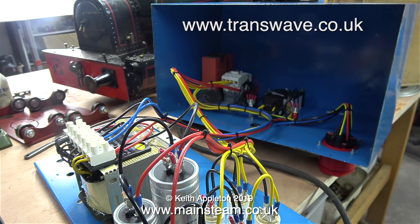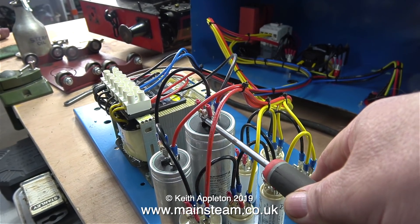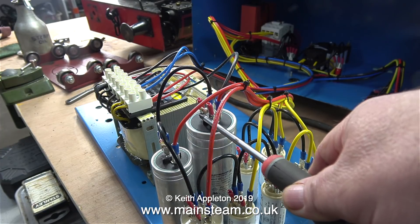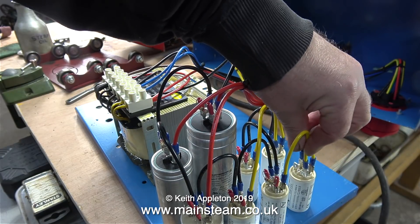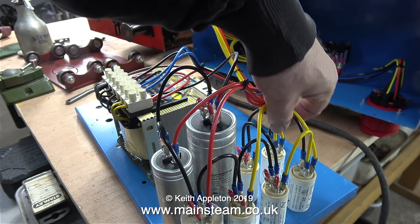In the bottom part of the picture there's a large transformer and here are the capacitors. I'm shorting them out at the moment which is never a good idea, but I know that they're not going to go bang for two reasons. This is about 10 minutes after I unplugged the unit from the mains, and also if you look at the capacitors you can see some resistors across them. In my younger days I used to work on Hammond organs and valve amplifiers, and over the years I've had a few shocks from capacitors in electronic equipment mainly by not giving them time to discharge.